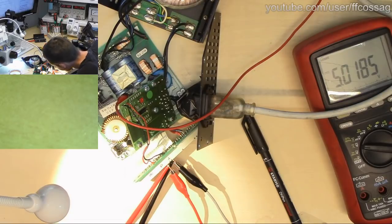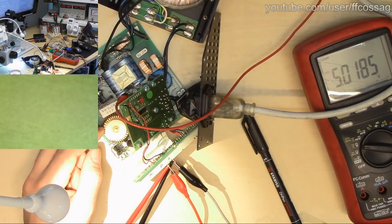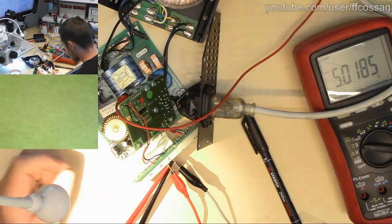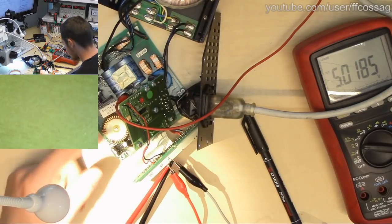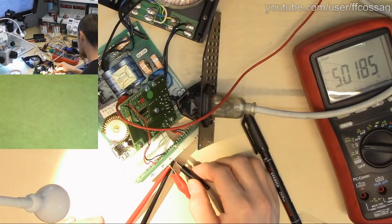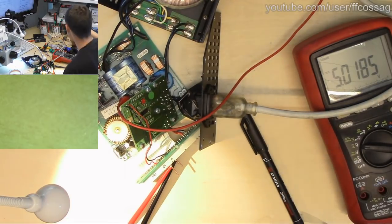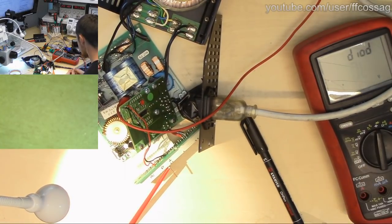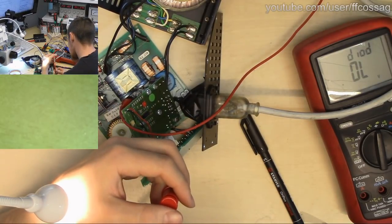And it's fine. I'm not sure how much more than 1 amp I dare draw. This inductor is pretty big, it can probably do like 2 amps at most. Let's try 2 amps and call that good. And it's dropping a bit, so I think that's pretty much as far as it's going to go. That seems absolutely fine, so we just have one more regulated test now, because I'm going to verify now that all of the 5 volt pins here are connected up in parallel. So we'll do diode tests for quickies. Yep.